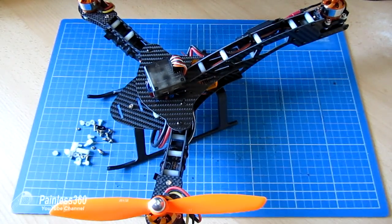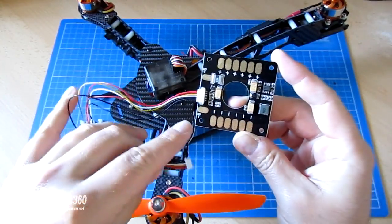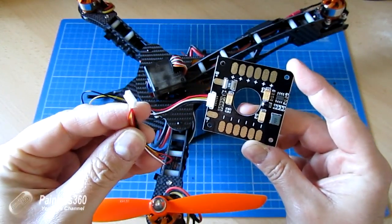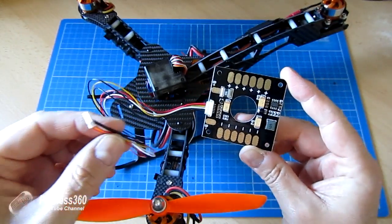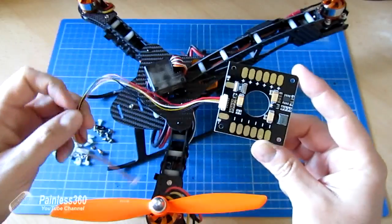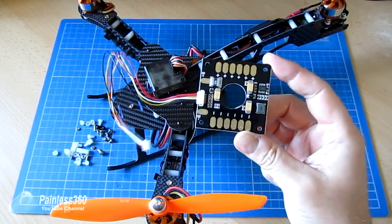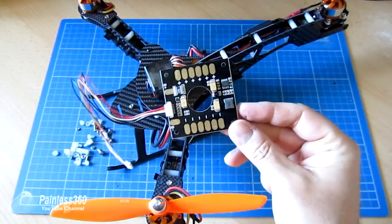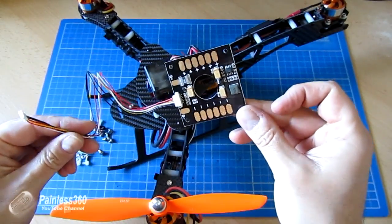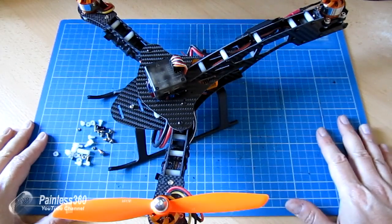The thing that we didn't use in this video was the power distribution board. This PDB I think is a really nice idea — not only does it provide the power connections for the quad, hex or whatever, it also provides the power out and signal bits and pieces that will fit into boards like an APM. I've not used that on this simply because at the moment it's not an APM flight controller, but if I was going to put an APM 3.1 or something like that on here, then I'd absolutely be using this. For the money I think this is a cute little addition that takes away the need for additional power modules and pieces, and reduces the overall weight. I'll put the links to both of these in the description so you can find them and order them.